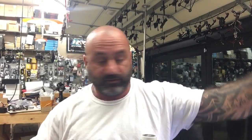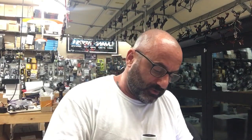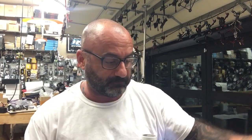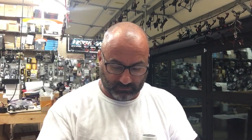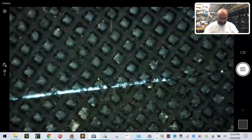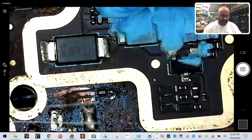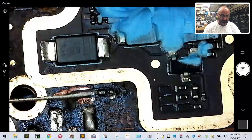So what you do is you take a wire, something super thin, like these here, okay, and you cut it, and then you literally tin the whole exposed wire, okay? So give you an idea what that's like, I'll put this here. You would take the wire, you take your strands, okay? Now you could wind them if you can make them small enough, but if you can't, then you actually pull them out strand by strand. All right, now I'm going to find out if this is small enough by placing this right here, and I think I can get away with it. It's going to be close, but I think I can get away with it.